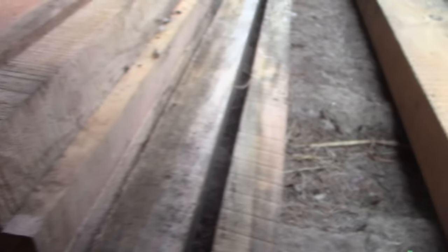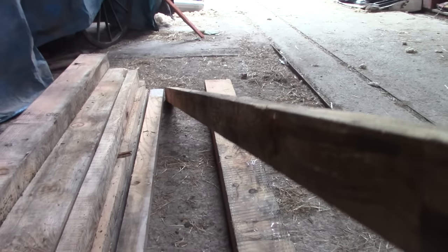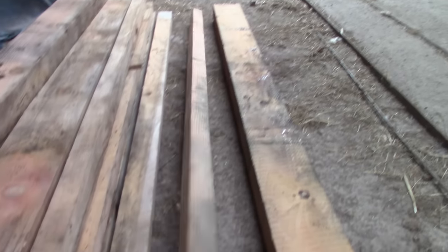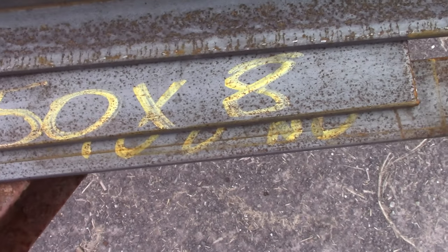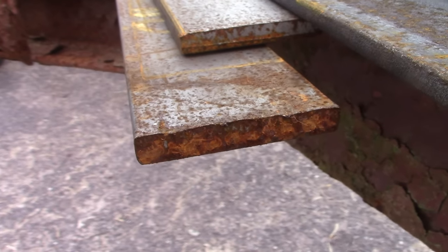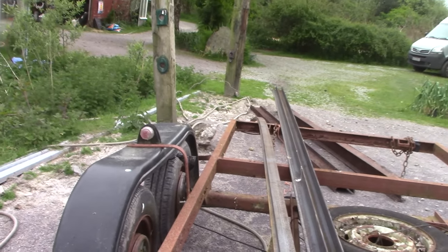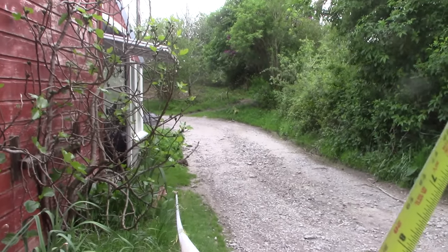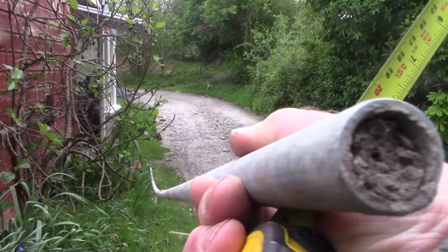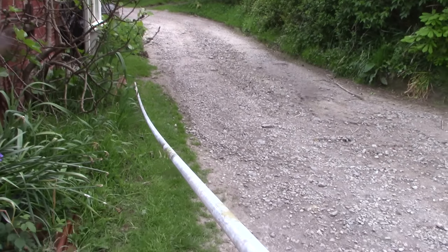My sleepers are made of wood — I'm using 3x2 Douglas fir. It costs around 50 cents a foot, so 1 euro per sleeper. The rails are flat bar steel; mine is 50 by 8mm and each length costs around 38 euro 50 including tax. The pegs are cut from round galvanized steel pipe. It costs about 14 euro a length and I get around 60 pegs from each length of pipe, making them about 23 cents each.